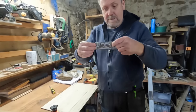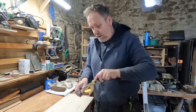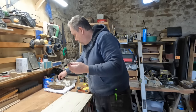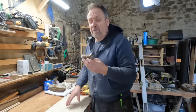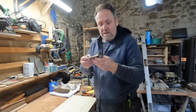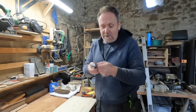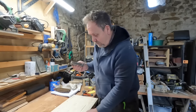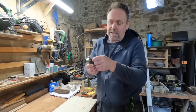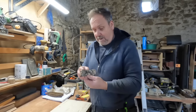This lovely little plane here, which is a Stanley number 79 on the back here. Stanley historically made the best planes ever. This one here and a little rebate plane were given to me, and forgive me, I've forgotten your first name, sir, but Mr. Whiston from Gravesend in Kent sent these to me because he thought I could use them as a budding carpenter. And I have never used them until this point. And I hope that I'm using them sort of correctly, just to take the edges off these raised panels. It seems to me that you can adjust this back, and it has blades here and here, so you can work it either way, and it's the perfect tool for the job.